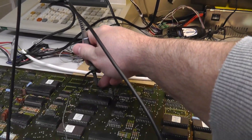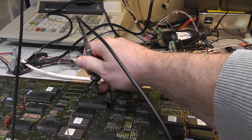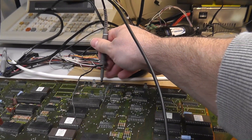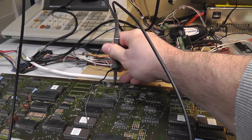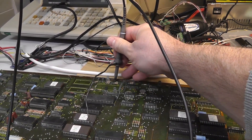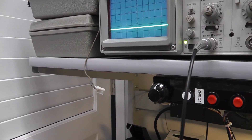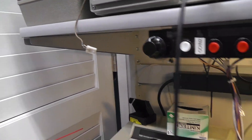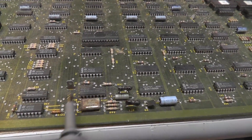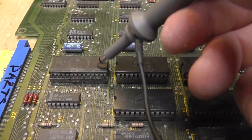Let's see what's going on with this bad boy right there. That transistor is actually somewhat working. Let me check the zener here. I think that zener is messed up - I should have more than half a volt on the other side. There's no clock, and on the graphics board I'm sure we could probe around, but I'm sure this is just jacked up. This is our clock counter chain - clock divider, I guess. Look how bad it looks.